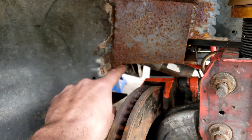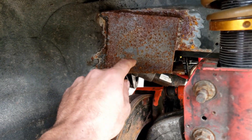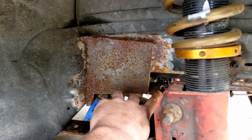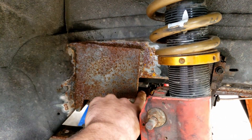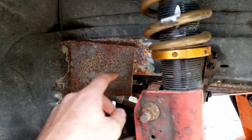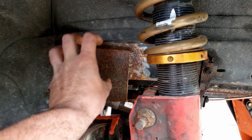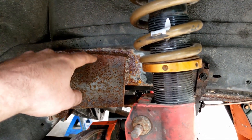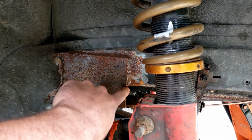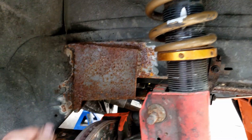One of the things I need to fix is cutting off these little overhangs where I repositioned the k-member originally, and then I have to finish off this plate here — basically just trim this off and do an upright piece to fix that up. Then I'm going to go back through and clean up some of these welds, because this was one of the first things I did. The welds didn't turn out too bad, but I've got the welder dialed in more now.